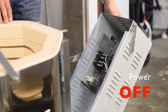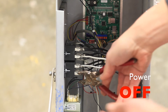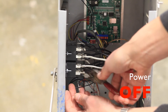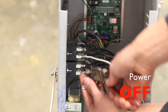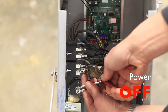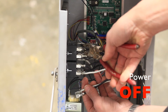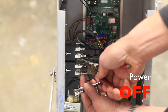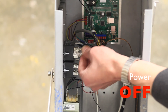These two rectangular black boxes are the relays. With a pair of pliers, we want to switch over the output from one of the relays to the other relay. The wires we are interested in are the ones on the end of the relay closest to you. Remove one pair of wires and hold them in one hand, then switch over the other pair of wires onto the empty terminals, and finally slide the two that are in your hand onto the other relay.